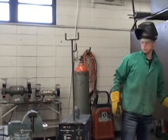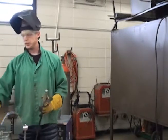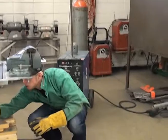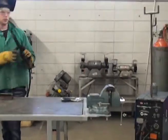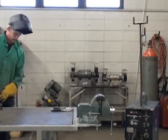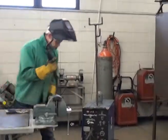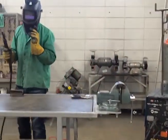Put your ground cord down so nobody trips on it. Next, take your ground clamp — if you're welding on something that's painted or rusted, you grind it off so it gets a good positive connection. This right here is your welding gun. The filler metal will come out of the machine through the hose and up to what you're welding on. Keep it straight to prevent it from hanging up in the hose. Get all the slack out of it. Next, go over here and turn the power on, and you're ready to go.